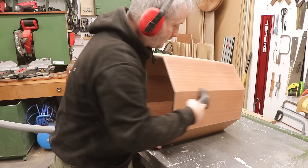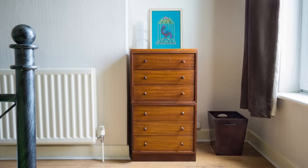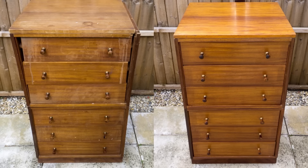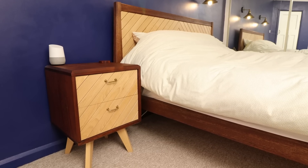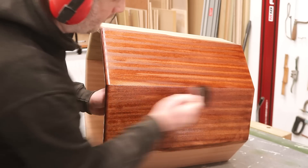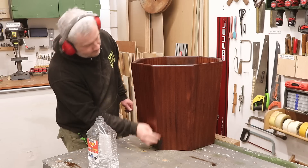After removing the dust I decided to apply a dark oak dye, but I added some white spirit just to thin it a bit. I'm basically trying to get the colour to better match the other items of furniture in the room where this is going to live — those items are a sapele chest of drawers that I found in an alleyway and restored a few years back, the walnut veneer storage trunk that I made, and the bed and nightstands. This is a spirit based dye so I'm trying to maintain a wet edge as much as possible to make sure that it doesn't go blotchy.